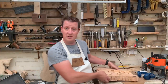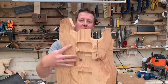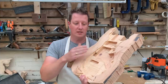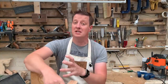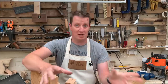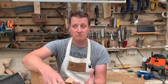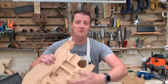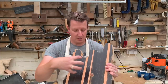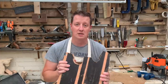That's got us to a point. Hopefully you can start to see now what I've kind of got in my head. We definitely have these raised sections through here which we can carve into wings. This lowered area will be the original Strat body, which in the next video we're going to be staining, spraying, lacquering, scratching — doing all those things to that original body so that it's kind of finished. Then we'll start carving the wings after that — that way if I slip with a chisel it doesn't matter because it's only going to make another scratch that we want anyway. I've still got a bit of work to do because I need to do all of that on the back as well — the cavity to route out in the back for the springs for the tremolo.